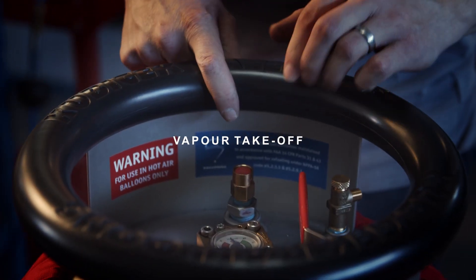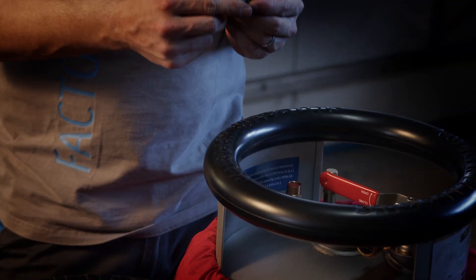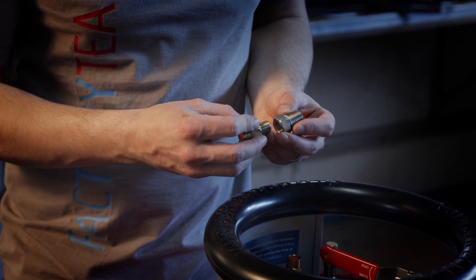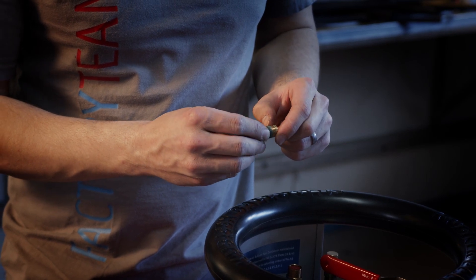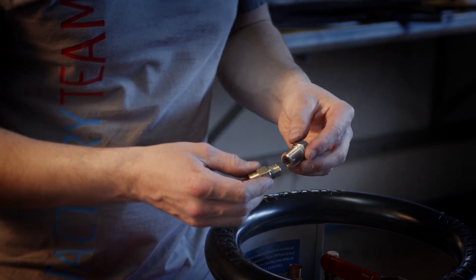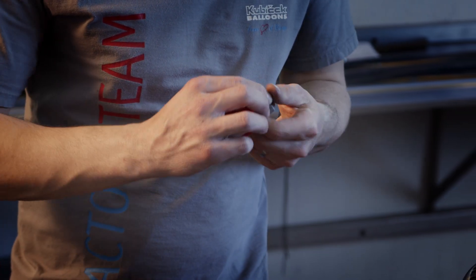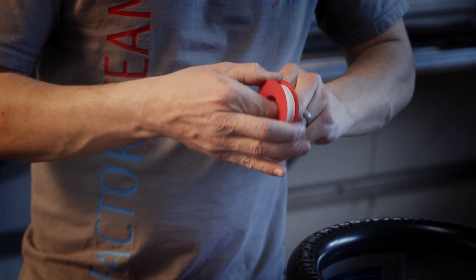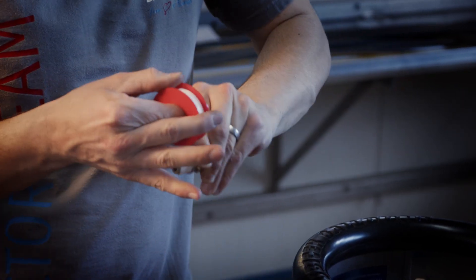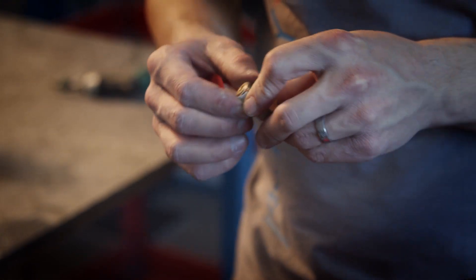If you have some leaking on a relief valve or adapter you have to remove it. In the next step you clean the parts with a brush because there is old Everseal. Now you can see it's cleaned and ready to be wrapped with Teflon tape. The adapter will be prepared for assembling inside the cylinder, and the same I will do with the relief valve.